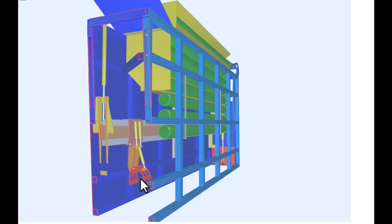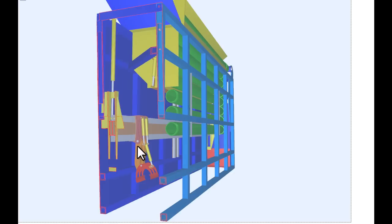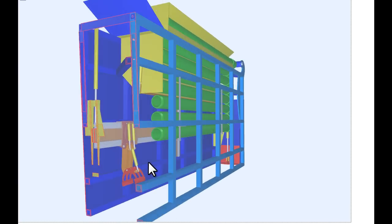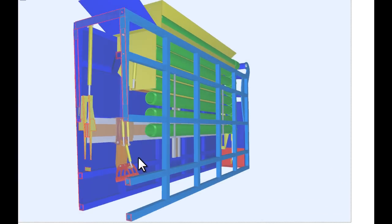This arm's got a couple thousand pounds of grip if needed. We turn it down to whatever, you can turn it back up. It has 1,000 pounds at 2 feet a second travel. So we can grab a pipe and back up and pop it in, or we can forcibly push it in with 1,000 pounds. We can change that ratio for smaller pipe to where we get 4 feet a second and 500 pounds, which might be plenty for a lot of these applications.